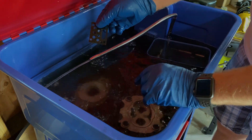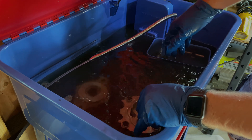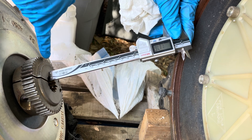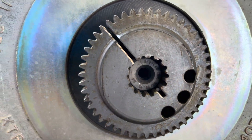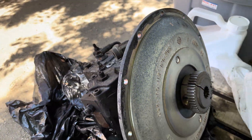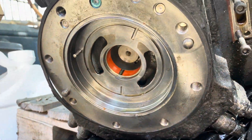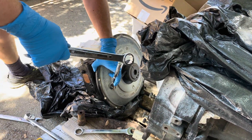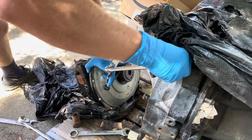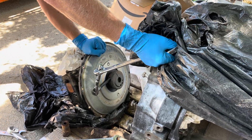I need to check and see if this is in a repair kit, because if it is then this will just get thrown away. I'm just going to let everything sit in here overnight. I went back and closely looked at the pump and was able to discover a data plate that was so covered in grease and soot I didn't see it the first time. After thorough cleaning I was able to lift the part numbers I needed. With that information I went to the Bosch website and figured out all the seals and kits needed to rebuild this pump. And guess what? That part that was $5,500 I was able to get for around $180.